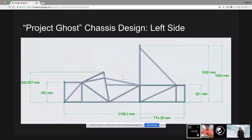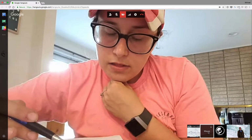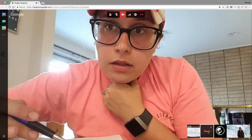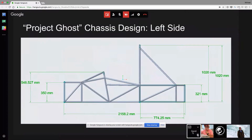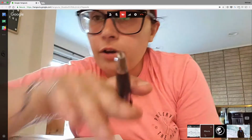Similarly with your main hoop structure, I don't know the rules this year, but I think in hybrid it was 30 degrees, so as long as you're not violating that. Yeah, I think it's at like 40 or something like that right now. High 30s or 40s. Okay, great. Last but not least, do you have your side impact structure dimension? Is that 250 millimeters?